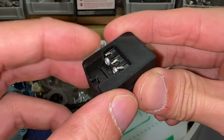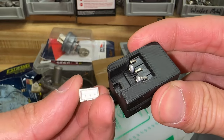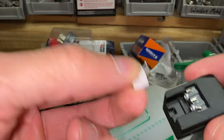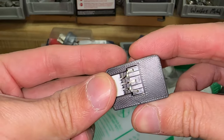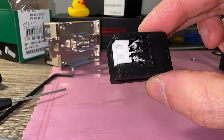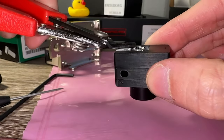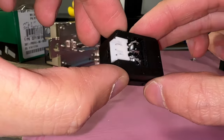The switch pins need to be bent down while making sure they don't short out against the screws. For the connector, bending the pins toward the notched end is easier since they are closer to that side. You would think that after wiring NeoPixels this would be easy — nope, it was just as horrible. The middle connection can be solder bridged, however I could only get tiny 30 gauge wire to stick and connect to the outer pins. Make these connections as flush as possible. The bottom of this piece butts right against the deck panel so I used flush cutters to trim it flat.